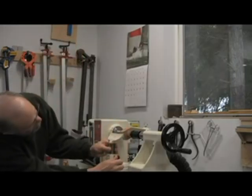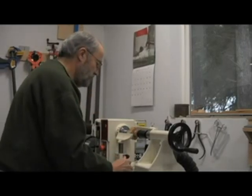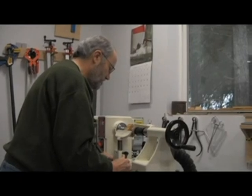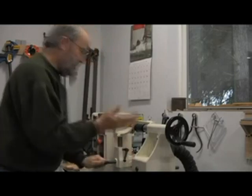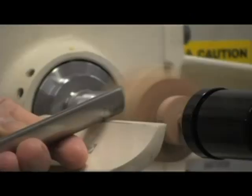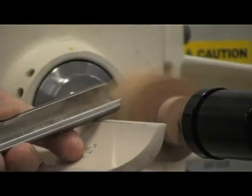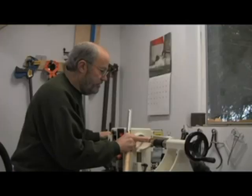I'll set that just a little below center, get it as close as possible — about a quarter inch or even less — and make sure it's straight against the plane. Using my roughing gouge I'll first turn it into a cylinder and get the square edges off it.